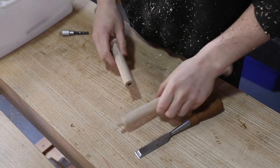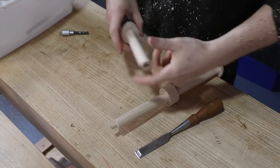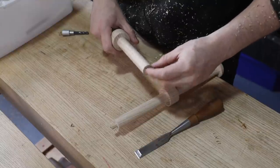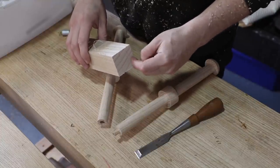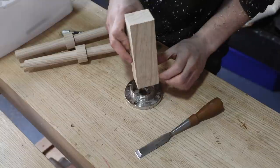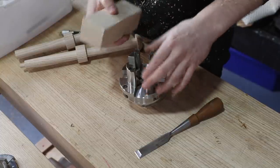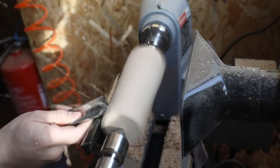In an ideal world I would have made this diameter a nice round number such as 20, 25, or 30, so that when I make a sleeve I could just drill out the centre using a forstner bit. However I tried to make this 25 but accidentally made it 24, and then sanded it afterwards so now it is 23. So when I make the sleeve to fit over it I'm going to have to hollow it out to create that internal diameter. The gripper jaws I was hoping to use aren't the right diameter — they don't quite close enough to clamp this — so I'm going to have to use the pin jaws for this job. I'll turn it round first and it's not going to be a whole lot of work to get that centre out, so I'm not too worried about it.